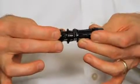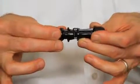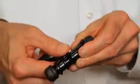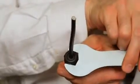The NEC 2008 compliance solution is a simple device, a clip, that simply goes in and disables the latches, and the hand tool is an ordinary screwdriver. Lastly, the flat spots on the nut allow ordinary tools to be used to ensure that the connector is sealed.